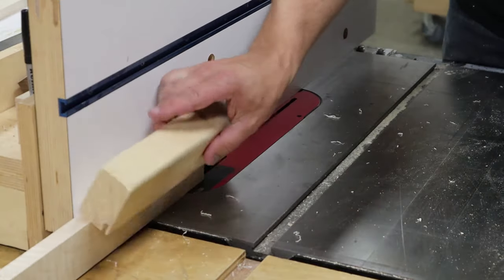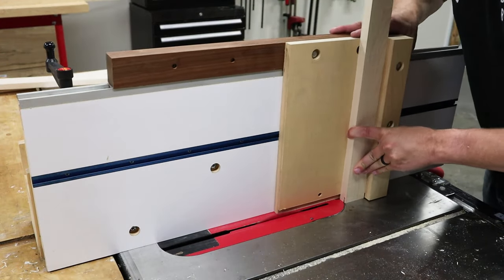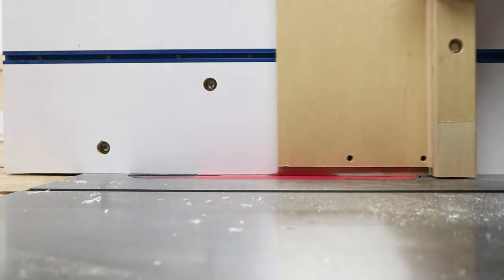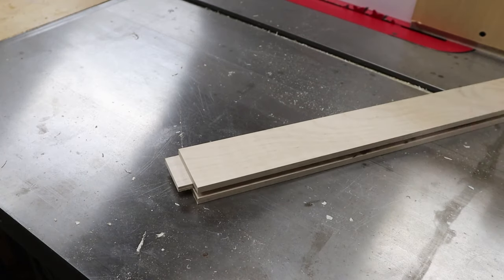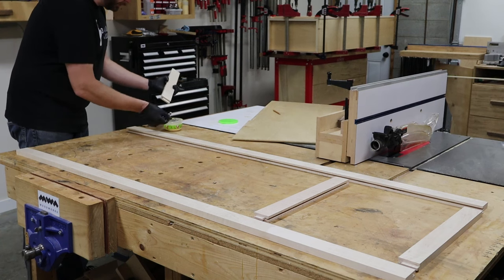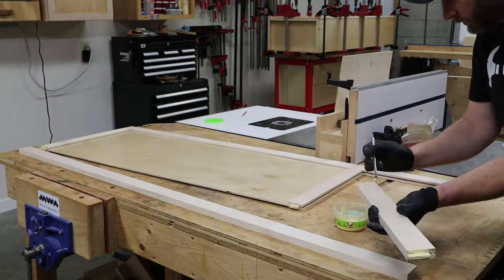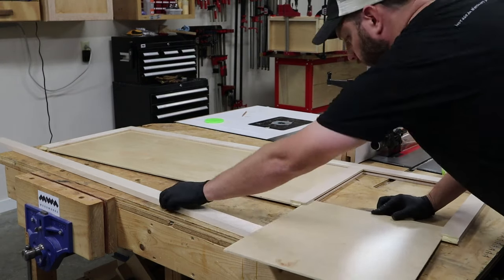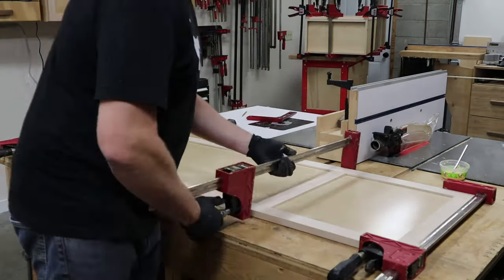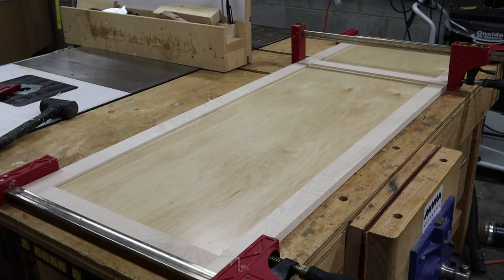I then used my tenoning jig to cut the tongues in each of the horizontal frame parts. These tongues will fit the grooves I made in each of the side pieces of the frame — I made the tongues one-half inch deep and just wide enough to fit in the grooves. I then put glue on the tongues and lined them up in the grooves in a similar way I did with the marks on the face frame so everything lined up where I wanted it. Getting the panels in place without wrecking the alignment of the frame was by far the hardest part, but after I slid that top panel in place, I could see the light. I just added that last side and then checked everything for square before adding the clamps. I really love this look of the hard maple frame with the pre-finished maple plywood in the middle — it is so awesome.